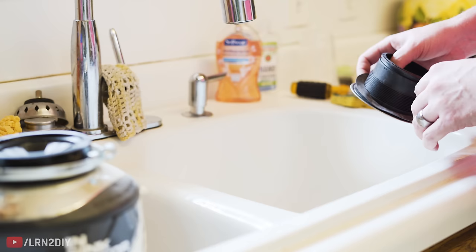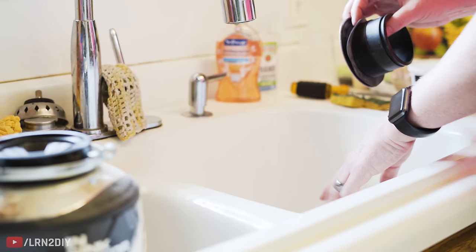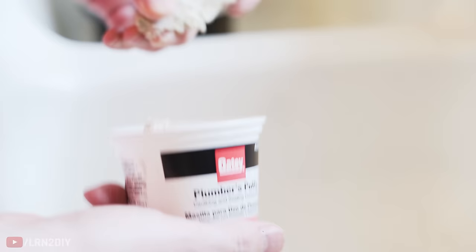You've typically got a couple of choices when it comes to sealing from the top. You can use the rubber gasket that comes with it if you have a fairly flat lip around the drain. In my case it's really curved so I don't think that's going to form a proper seal, so I'm just going to use some plumber's putty to form a little ring and use that to seal everything off — just like playing with Play-Doh. Roll it into a snake and make a circle big enough to go all the way around the ring.